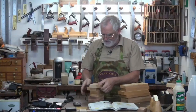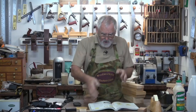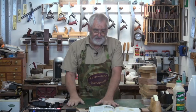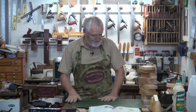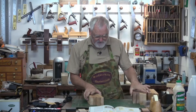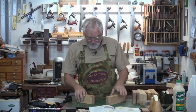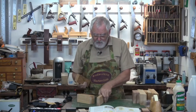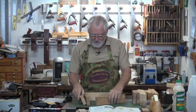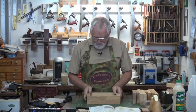So we're back. And we have our sides, our ends, and our sides. You can make a very simple box or pencil case using this method. If you can, it's nice to get it in one full length because then all the timber matches. If not, just work with whatever you've got. Now, I've got rough sawn, so obviously the rough sawn goes to the middle and the smooth goes to the outside.